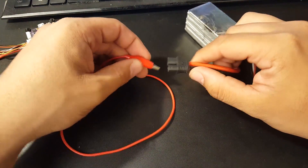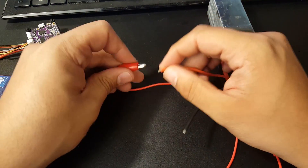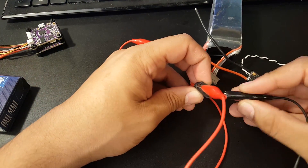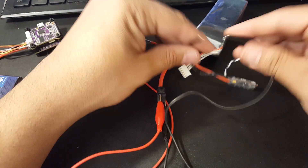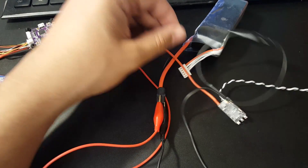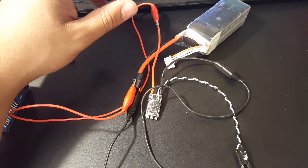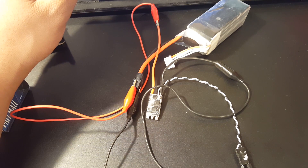Alright, I've got myself a battery. I'm going to take power here — here's positive, we'll take positive here. And taking negative with the alligator clip. I'm going to connect it through the Arduino and double-check everything, because if it is BLHeli 32, the next step is to actually test telemetry on this ESC. In theory we are connected. Let me find BLHeli 32 on the PC and we should be able to test it.